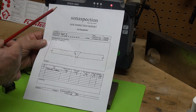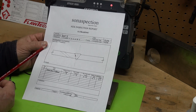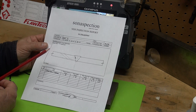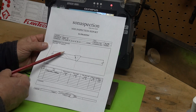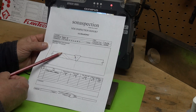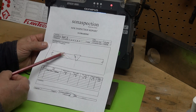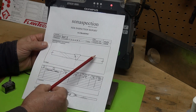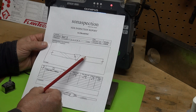I'm using a 60-degree probe, four megahertz, 10 millimeter diameter, and I set my reference at 63.8 dB using a side-drilled hole in the IIW block. Let's take a look at this — kind of like sidewall fusion, we hit it at 60 degrees, we'll hit it very well and get a good signal from the downstream side of the weld. On the upstream side we may catch some tips but won't really see much amplitude.